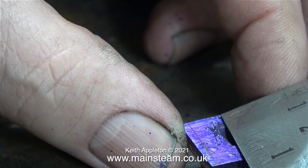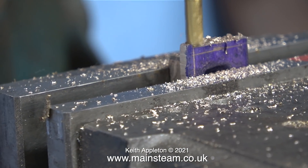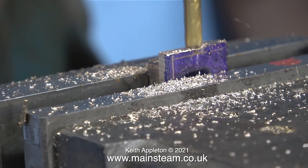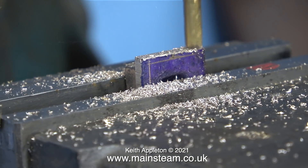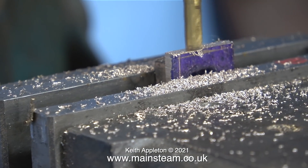The second dimension isn't really that important — a bit more than three quarters of an inch is perfectly fine. The critical dimensions are just the top and bottom of the valve, and also the slot I'm going to cut in it. When I turn the valve over you can see that the sides taper, which is something to do with the casting process. It really needs to be square, but for the moment I'm going to work on the other side. Now over to the milling machine where it is firmly clamped in the machine vice.